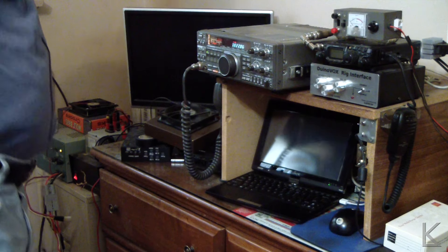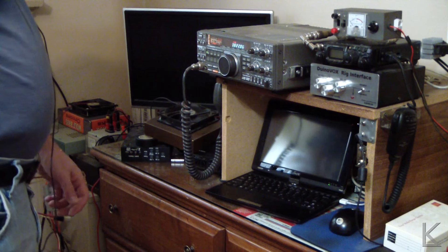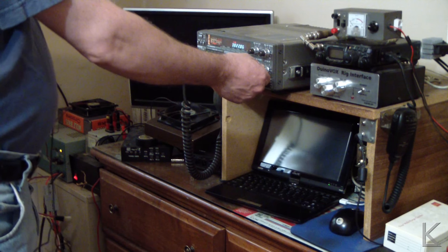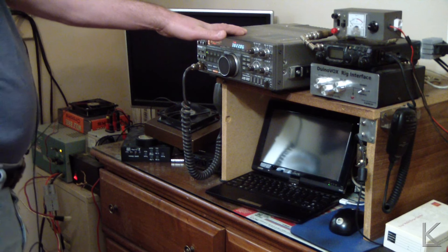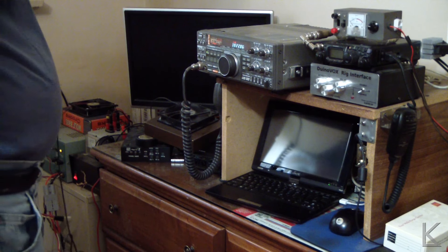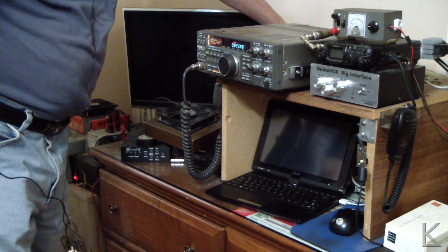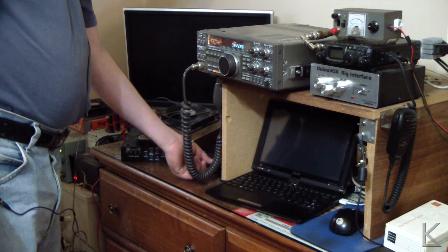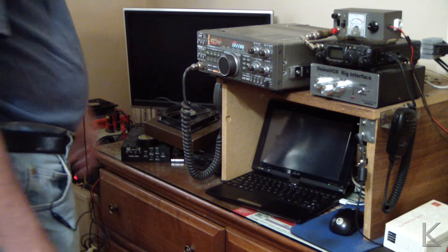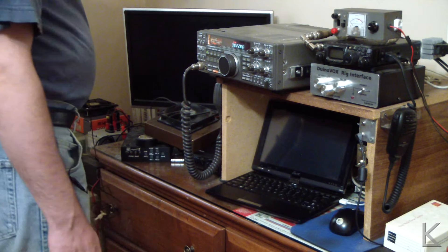We're back upstairs, hooked back into the old Heathkit power supply. And as you can hear, our whine is very, very loud and clear. I have not yet hooked up the antenna — all that I have hooked up right now is power, and we've got that whine. I've started turning things off: I shut off the computer, I turned off the LCD monitor — no change. I turned off my Radio Shack DSP and took it out of line. We're just hearing the internal speaker in the Kenwood now. I can turn off this Astron seven amp supply, and we still have the whine.